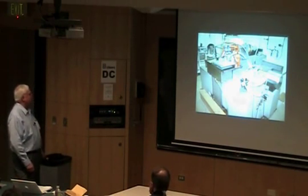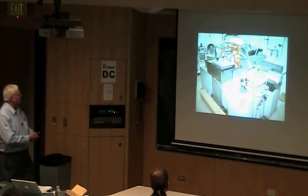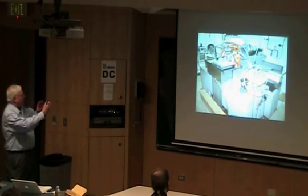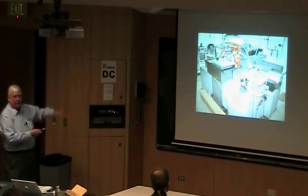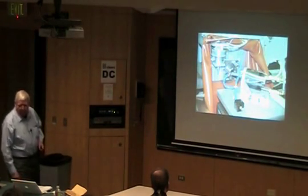All right, look at it from different directions. It's got rubber sheeting to keep the mess from going where it shouldn't go. There's a flat table here that holds the grinding spindle, and over here is a plate that holds the work in some way. That can move in and out. It can go left and right, and this front table can go up and down. So count them, all 3 coordinates are represented.